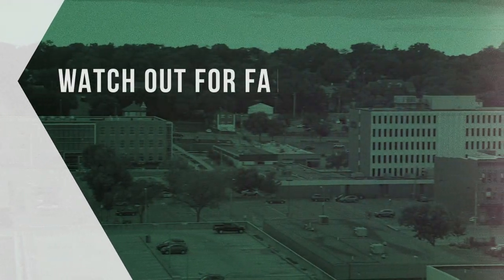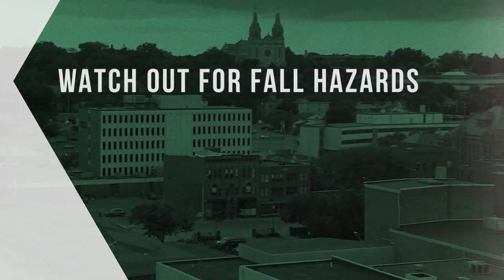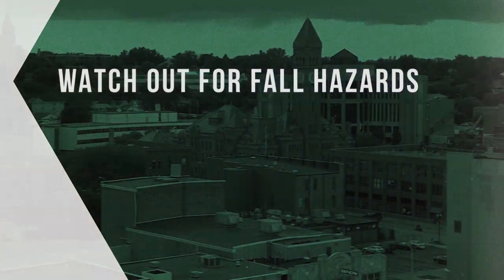If you use fall arrest, don't forget about a rescue plan. Be sure to keep your eye out for fall hazards, such as roof openings, skylights, and access hatches. Make sure these hazards are covered or barricaded and that you have proper PFPS.